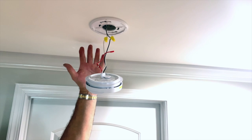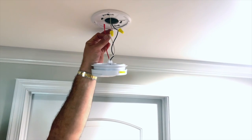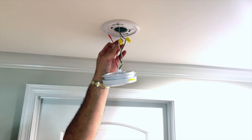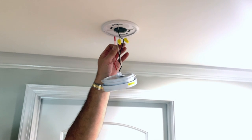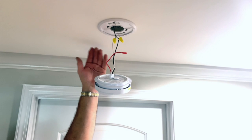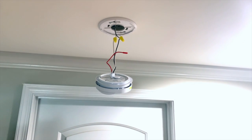So we need to get this wire — this two-strand wire — and replace it with three-strand wire that has an extra red line on it, which is known as 14-3 wire. I have a piece. So I've got to try to get this down, get that wire out, get a new wire in, and tie it back onto the circuit that we've got working everything else.